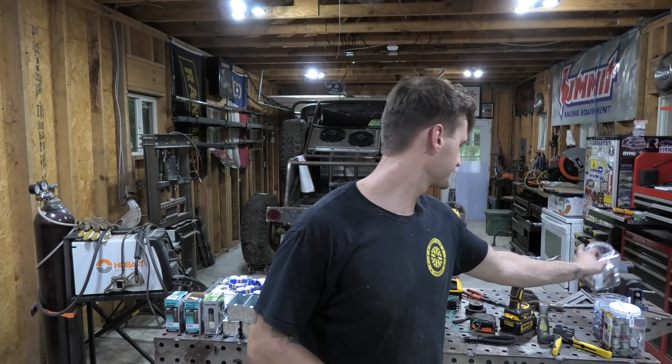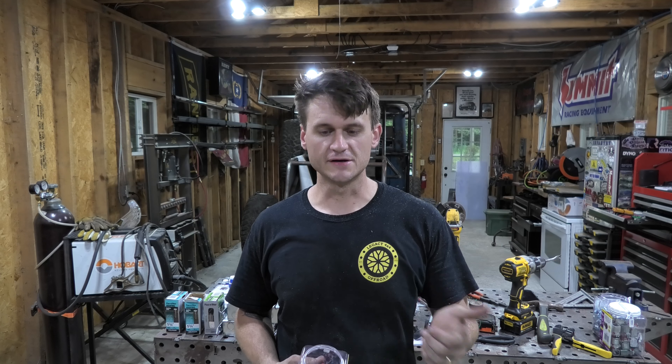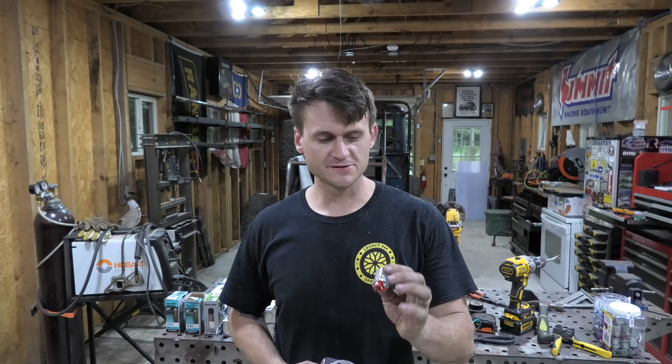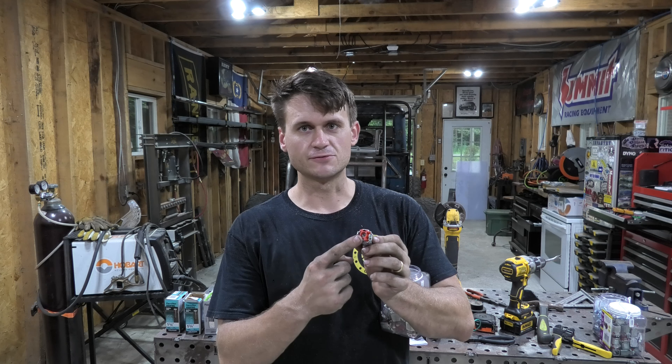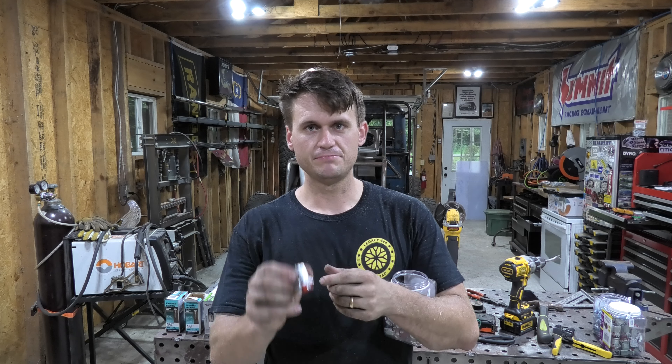I'm wiring this the exact same way the rest of the shop is wired, making sure the colors are all coordinated, and I'm using a lot of the old wiring to start what I've got going on here in the back of the shop. It's taking a little bit of time because I've got to pull an outlet off, make sure the wires match the way I want them to, and then push that to the next one. To use AC cable, you have to use some kind of bushing — these little guys are what the rest of the shop has. They've got an anti-short bushing, this little red portion here, and then this metal clip which pinches into the metal boxes I use throughout the shop.